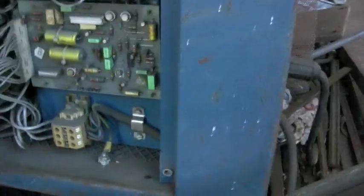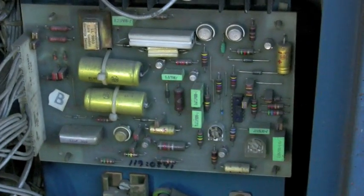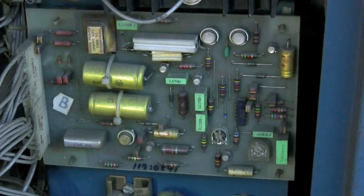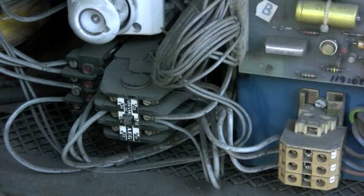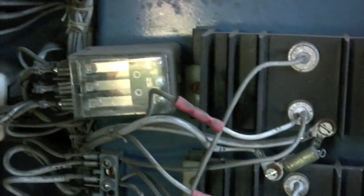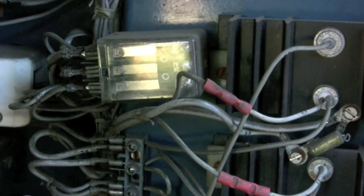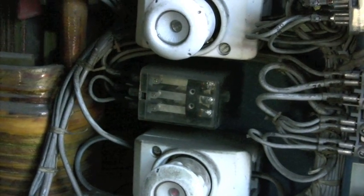This is the only circuit board there is. I'm surprised there's any circuit board at all because it's pretty ancient. So I don't know if anything on there is controlling the solenoid. But the fuses — those two are okay. That contactor pulls in and out fine. That relay's working fine. You pull the trigger, all of those trip over. Same with that one in there — all trip over. The other fuse is fine.